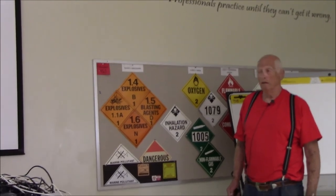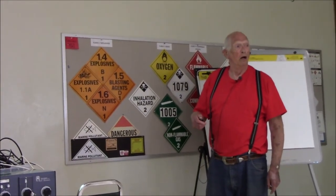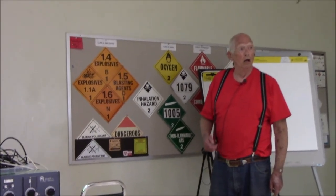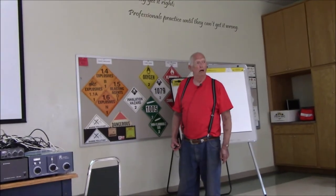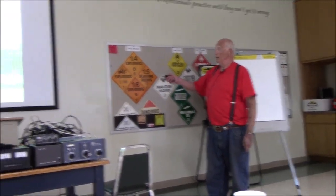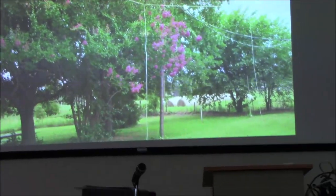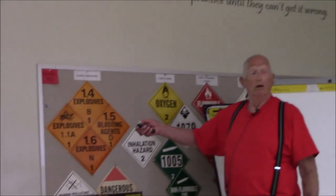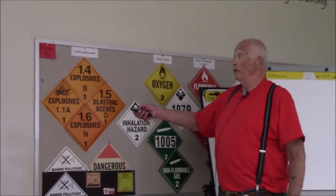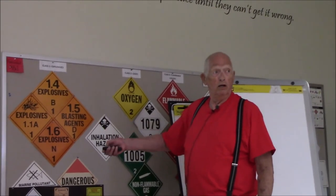Conrad, you said the top wire was 27 feet on all of them. Is there something special about 27 feet, or is that just what you happened to have? On the 10 megacycle one, the 30 meter one, it's only 17 feet. Oh, okay. That's 17 and 8, and the 40 is 27 and 12.